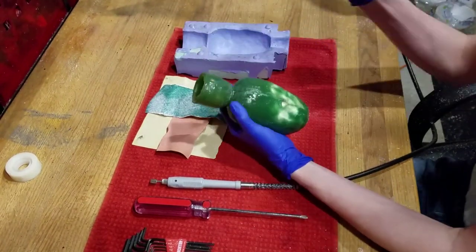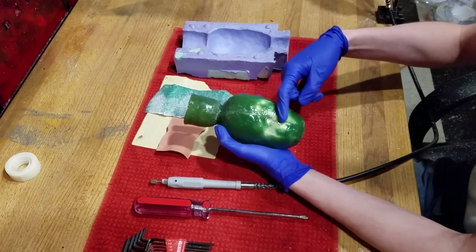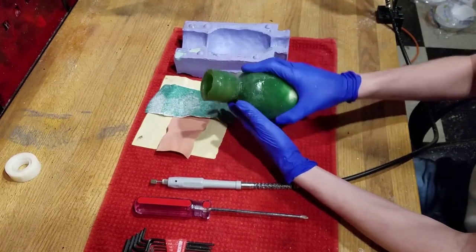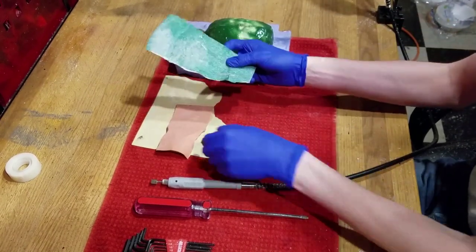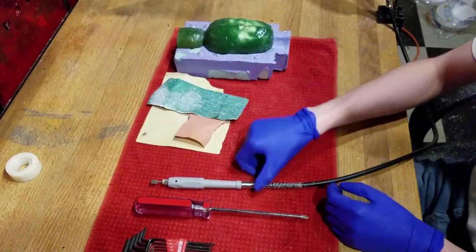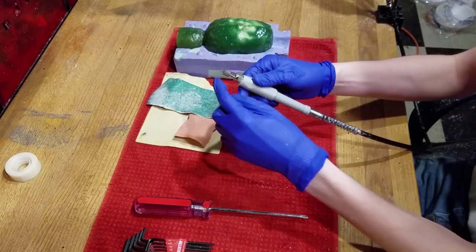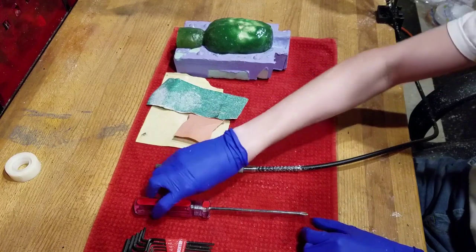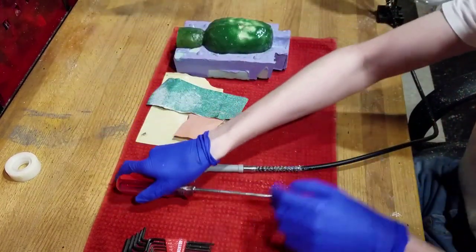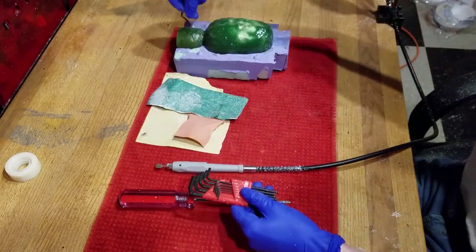Now I will begin to fix my project. It has very thin walls, as seen here, so I did not remove the foam inside of it to avoid breaking it. I will recast it using one half of the mold. You will also need some sandpaper, a Dremel with a nice cutter bit, a long, sturdy poking stick so you can jab at the foam, and any bent poking stick that can reach around the corners of the flask.